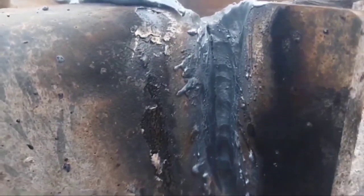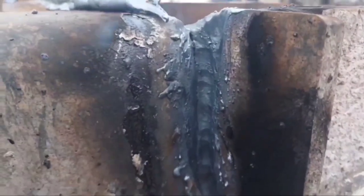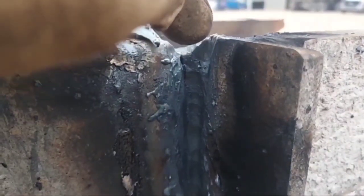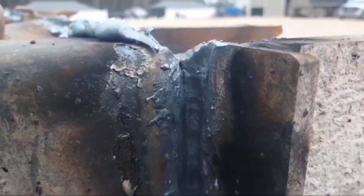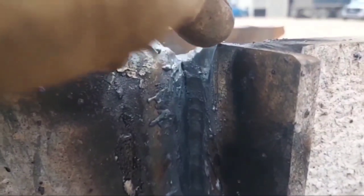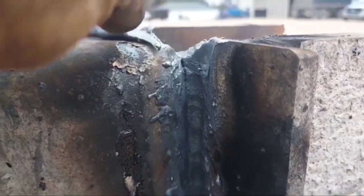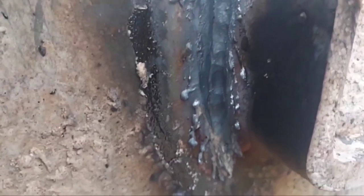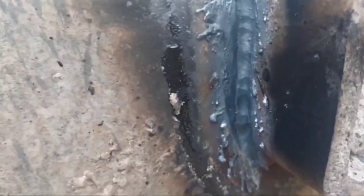Unfortunately, that's about all I can get on video. I ain't got no angles for anything better, but basically all you do is you take your wash tip and you just start whittling at the end until you see the separation line between the frame and what you're trying to cut away from it. And you can kill this as much as you want to because you're replacing it. So you try to save the frame and you just work that little line all the way down through there and it separates. Done. I gotta cut the bottom yet, but you get the idea.